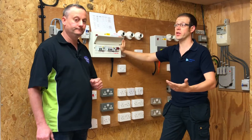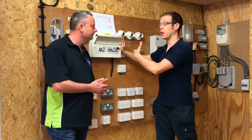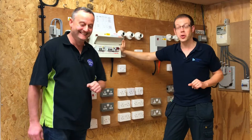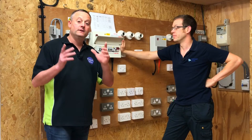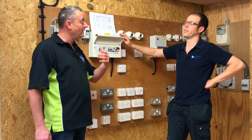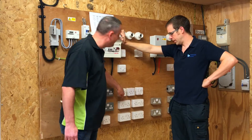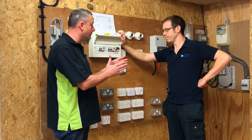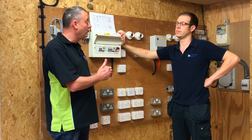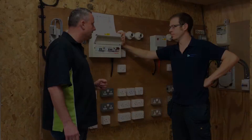There are also pieces of equipment you can buy that help identify the circuit - plug-in tracers that you connect to a circuit and then scan along the board with another device which alerts you to the correct breaker. We don't have those at this college yet. Based on the discussion with the property owner, the three socket outlets are fed from the 20-amp breaker on the radial circuit, and the seven points are on the ring final circuit fused at 32 amps. So we're looking for a 32-amp Type B breaker - but we're still going in with the view that it could be the wrong breaker, and everyone in the installation has been informed the power may go off.